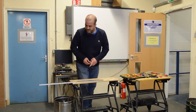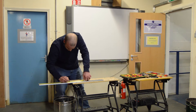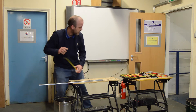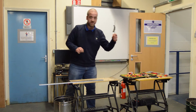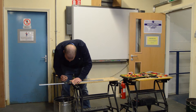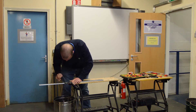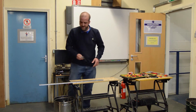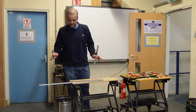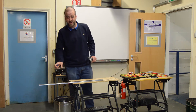And then we measure the midpoint of the bend, mark it, use our engineer square, draw a line in pencil on the midpoint of the bend. Now we're going to draw two further lines outside of this bend and they're going to be 70mm either side of the bend.